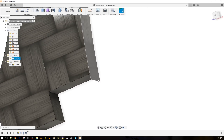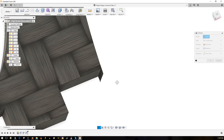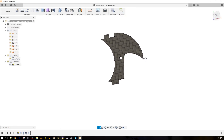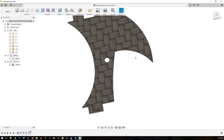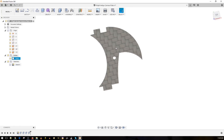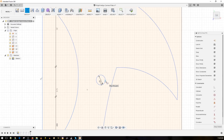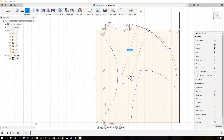There's a little artifact here that should not be here — we can fix that. That looks pretty nice. Let's go ahead and remeasure: from the middle of the hole to the edge we have 17 millimeters of space, and it's around 16-17 on the other side too — so it's about a 17 millimeter theoretical circle. I don't think you'll need anything on the bottom; this fang design will take most of the impact, especially since you're usually tilted going head-on, and I think that's going to hold very well.